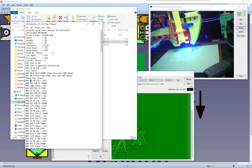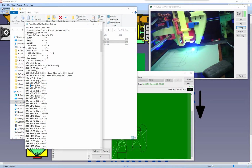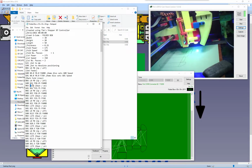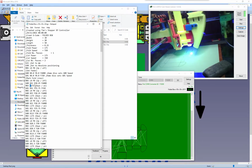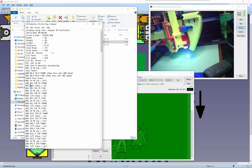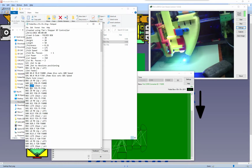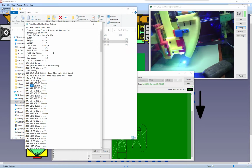I think they've used S for spindle speed, because now we have machines where we don't need a gearbox. We can just vary the speed of the motor with a few electronics. So we needed to add something to control the speed of the motor. I think GRBL is mainly CNC, so they went for the S, and they've kept the S for the power of the laser as well. So if you've got GRBL set up in laser mode, then when you use the M3, you can have an S here to set the power of the laser.